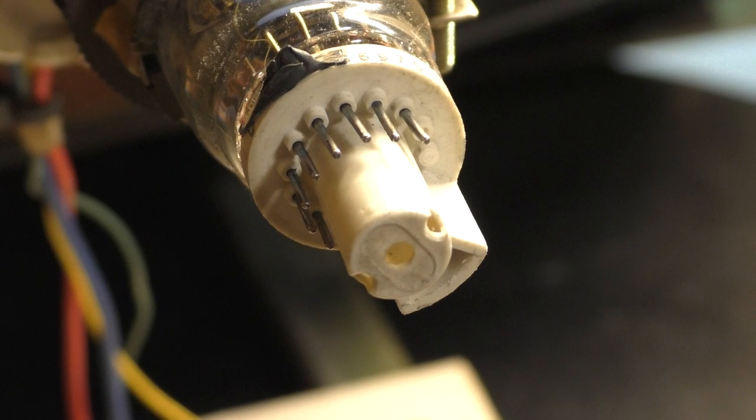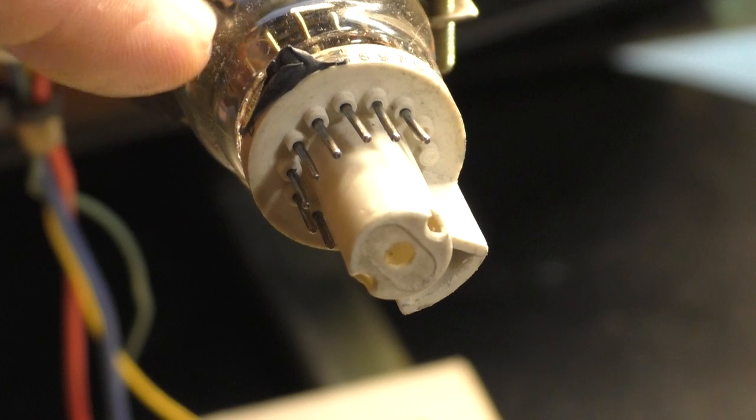I worked on a K7000 number 2 in the repairathon of 5. It was just an absolute nightmare. And I got towards the end and I thought I had fixed it. And I powered it up, and I got high voltage and it worked. But I had no picture. I had no raster. And I had no heater glow in the neck.